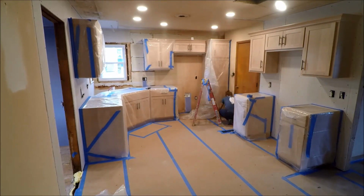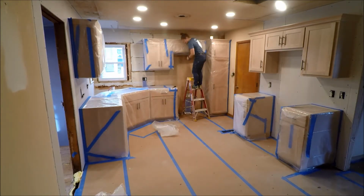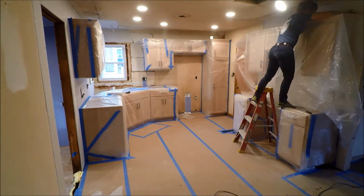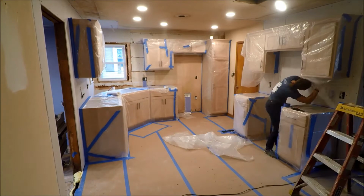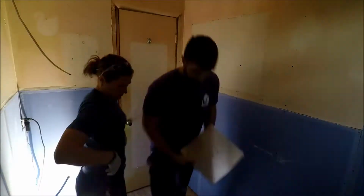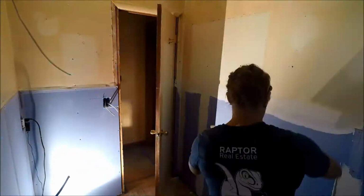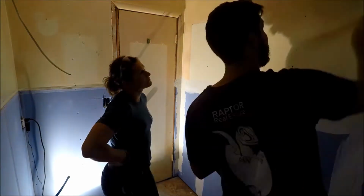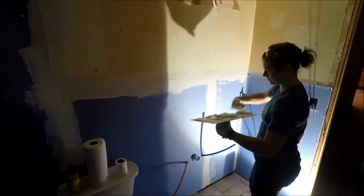Unlike paper tapes where you have to lay a layer of mud and stick your paper tape on it and get it wet and all that stuff. But I feel like the paper tape probably would have done a better looking job at the end because there's no texture to the paper tape. The paper tape is smooth on its own, whereas the fiberglass tape has little ridges, because it's a mesh. Is there a strength component that is really needed, or is it pretty much just cosmetic? Pretty much just cosmetic.